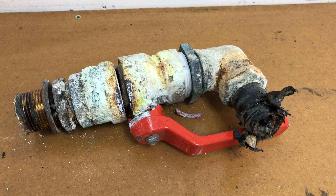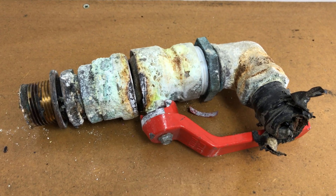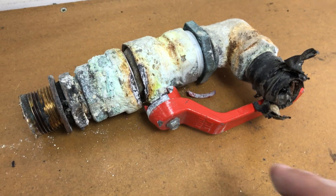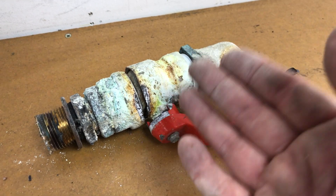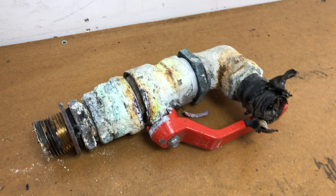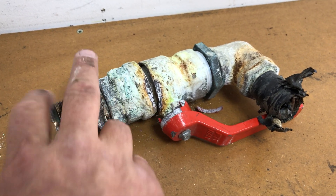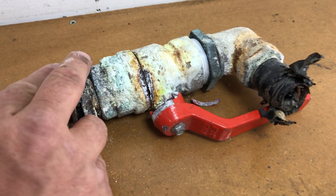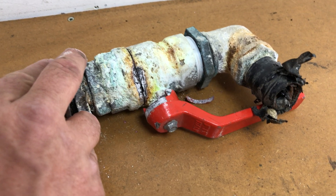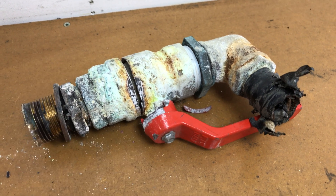Most people recommend you change valves every five years to prevent this sort of thing happening. Always make sure your anodes or cathodic protection are working properly - that will lengthen the lives of these fittings and reduce the chance of de-zincification. This is Tim from Boatshed Brighton showing you a recent valve that failed on a boat in Brighton - which, if the boat had been in water, could have caused an uncontrollable flood. Hope you got something from the video and we hope to see you soon - cheerio.